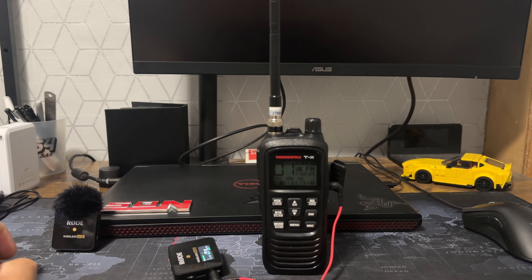I have now moved over to the iPhone's microphone — the microphones on these are not great but they're alright. We're going to power on the radio, then press menu and then press menu again. Here we're on the flashing VOX setting. The higher the number the more sensitive it is. I usually leave it on two, but you can put it on three or four depending on the microphone you're using. Once that is in place, tap through and we're set.